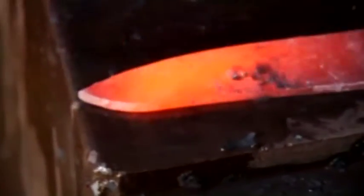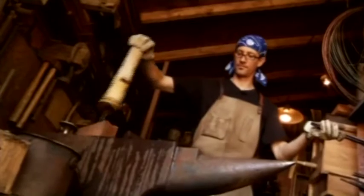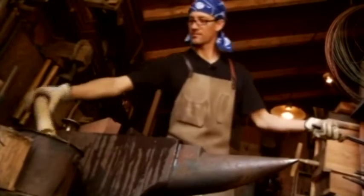It kind of led further and further until the point where I realized I don't have to use a grinder or a sander if I learn to forge well, and then I can do all my finishing by hand filing. I'm working at the edge here so that I don't put the corner of the hammer into the anvil, because it's kind of wedge-shaped and as I work this edge down, the piece wants to become a banana and curve up, so I'm always fighting that by resetting and straightening.